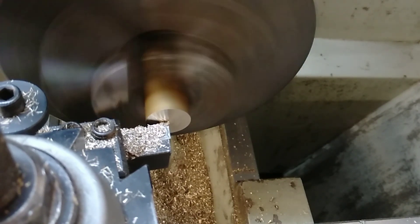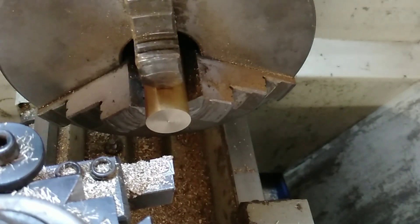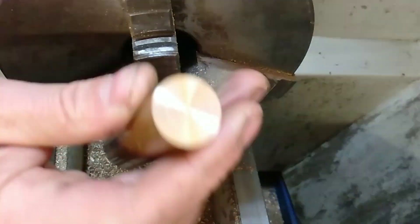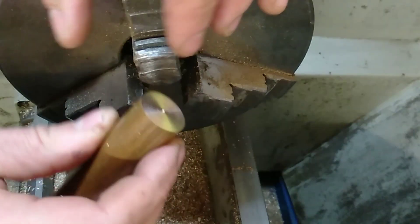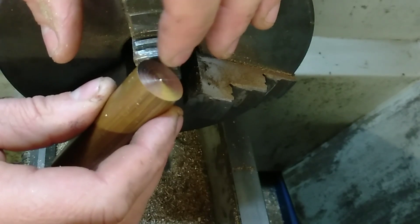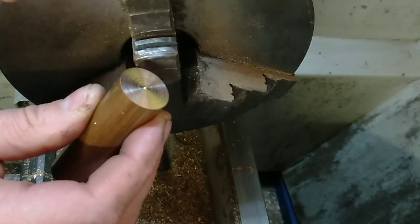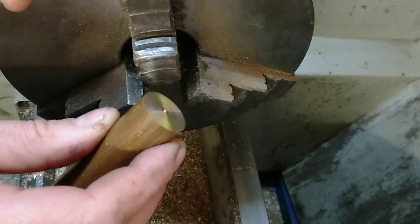Now that it's cut to the center, we can wind it back, and what we have there is a nice faced-off section that is now precisely perpendicular. There is a tiny little section in the middle left — what that suggests is that the cutting blade wasn't quite the right height. If it was a quarter of a millimeter above, then that would have tidily finished that off. But as it is, we've got a faced-off section and we can now start working on the rest of our project.